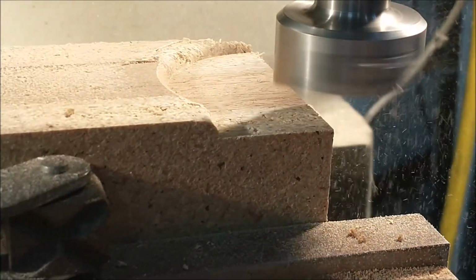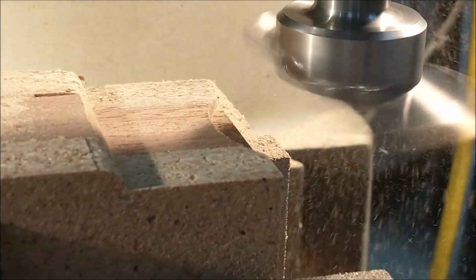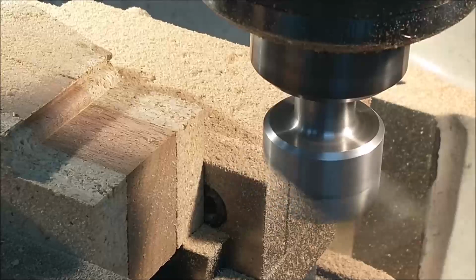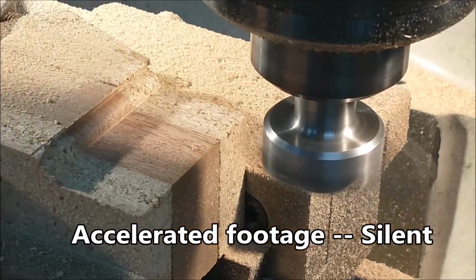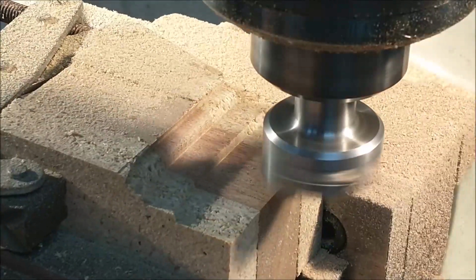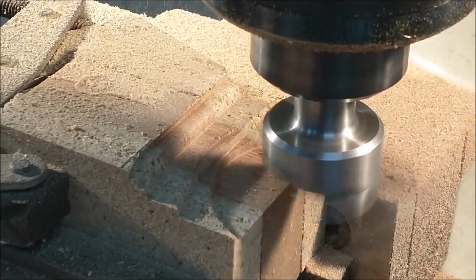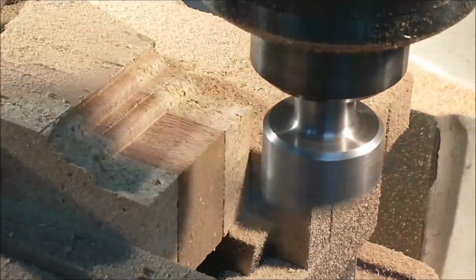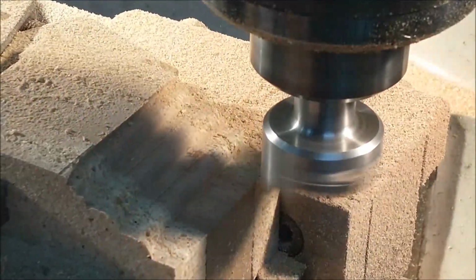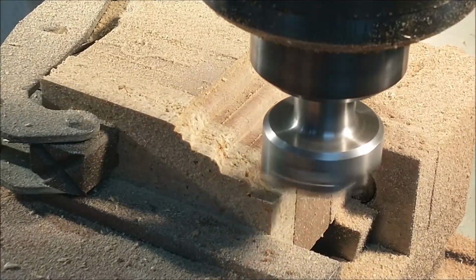You can see how effective that sandwich board's front and rear were this time for this operation. And yeah, I know the tool's a little bit deep right here. You'll see the secondary step on the leading edge of the radius when the tool is set to the proper depth. That is because I am coming back at a later operation. You see the second step right there, the little hairy burr. I could probably sand that off, but why bother? I'm going to adjust the whole setup down just a little bit and come back across it and wipe that right off.